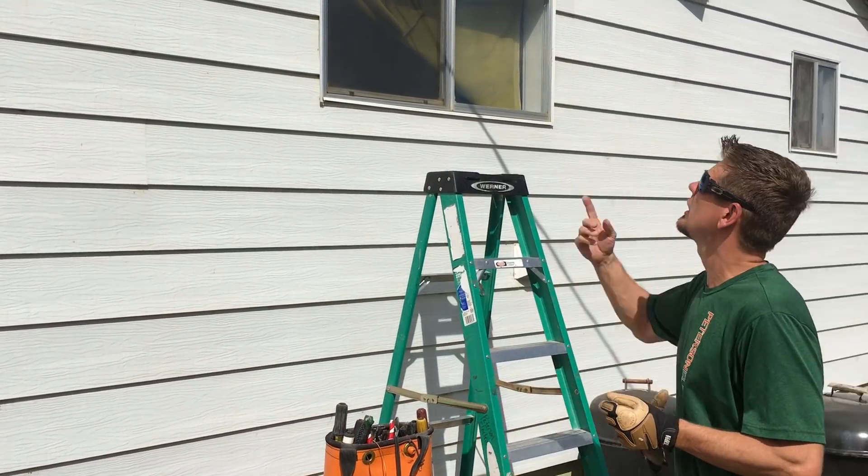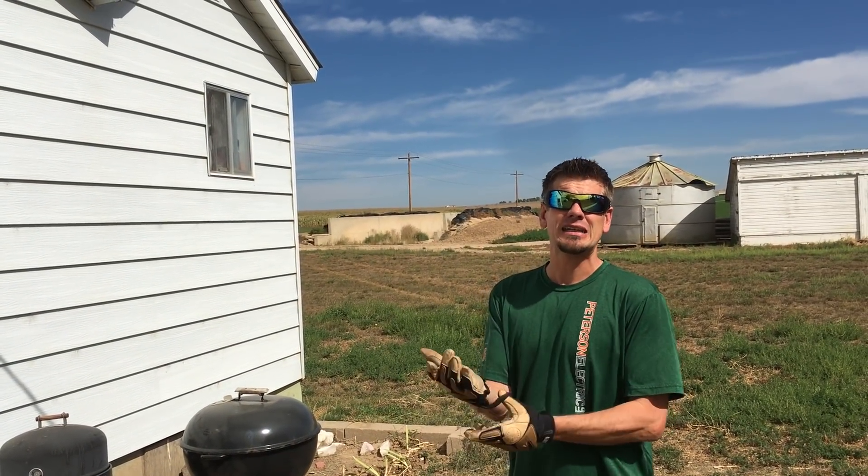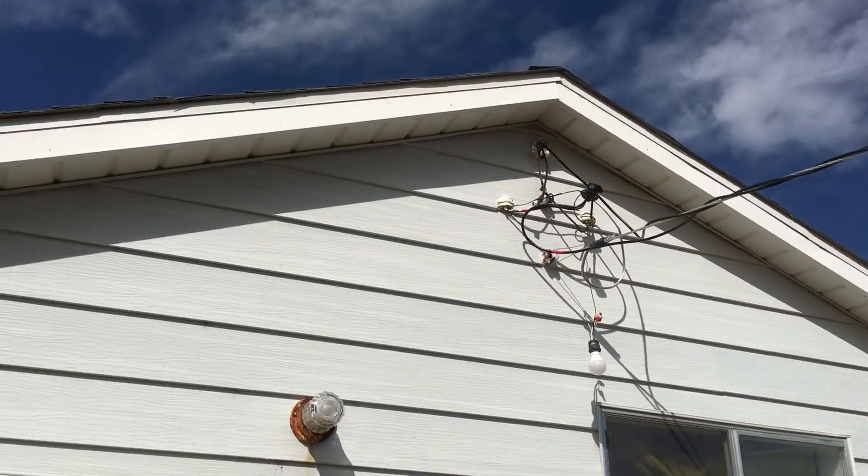Because what if it's 80 volts? That light bulb is not going to light up if it's less than typically 90. But on that right there at 120, it will.